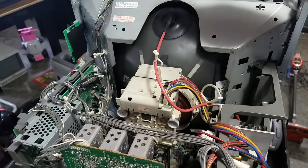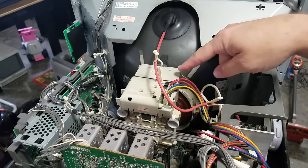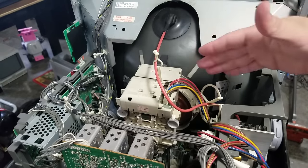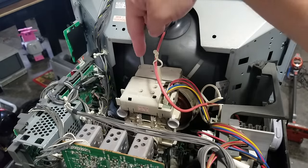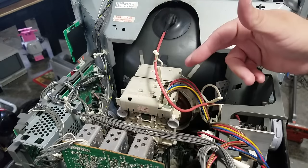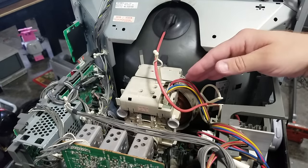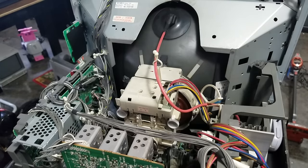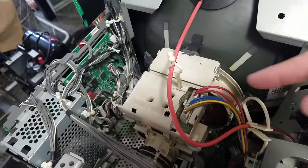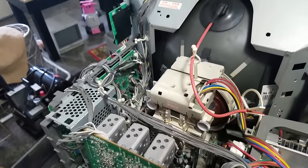Looking here — we've got our anode cap; it's not plugged in, don't worry. The thing that's extremely different on this monitor is the yoke. This is a much more heavy-duty yoke with a lot more going on — a couple more adjustment potentiometers which I'm not entirely certain about, but I believe they may be some color controls. I'll do more research in the manual. I'll try to get in closer so you can see how mammoth that yoke is.